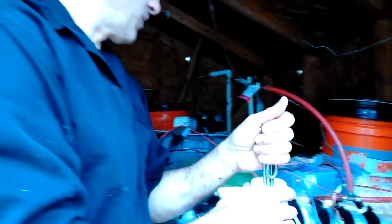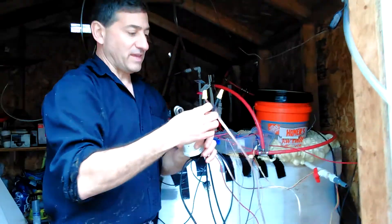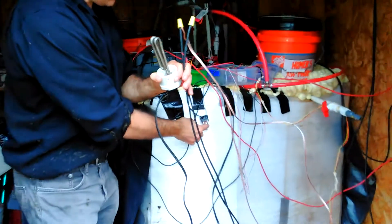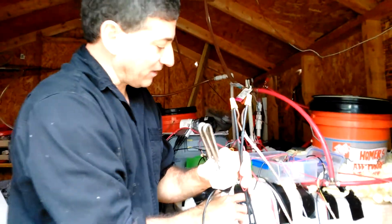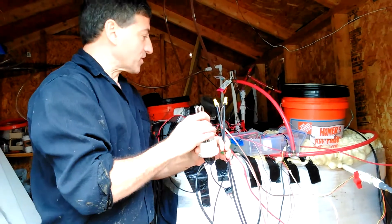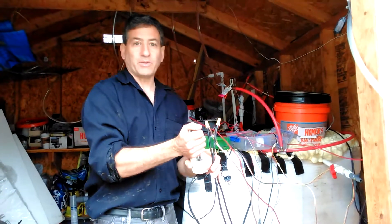So we wrote to Taha and he suggested: why don't you just go directly from the solar panel to the DC load? So that's what we did. There's no positive or negative on these things, so we just wired one and the other and went through a switch — we have a toggle switch here — and then up in the top of the tank, buried under the insulation, is a thermostat. The only one we could get shuts off at 30 degrees, which would be our ideal temperature. Good luck getting this tank up to 30 degrees Celsius, but we have that in case when we're gone. Even though it's a really cold day and the ambient temperature now is down about six or seven degrees Celsius, and it'll drop below zero tonight...